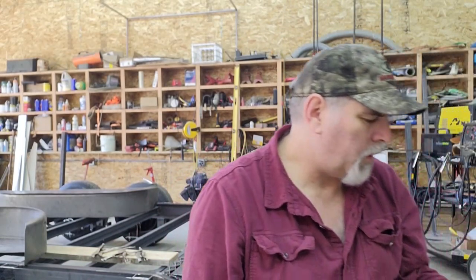Okay, that grinder's all fixed up. I thought I'd maybe share that with you because some of you may have experienced that before. If you've got a grinder, drill, it doesn't really matter, anything that you've had for a lot of years and the cord goes through a lot of bend cycles, and then if you start having an intermittent working problem, it's 99% of the time a spot in the wire that's from being bent enough times it breaks the conductor on the inside, and that's indeed what it was on this grinder.